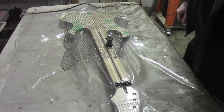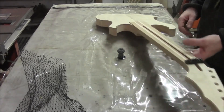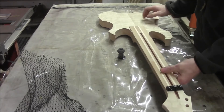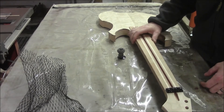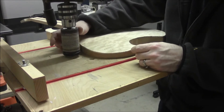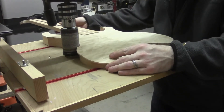Listen for any leakage — don't hear anything, so we're good. It's been about four or five hours and the glue's had plenty of time to set up. We've taken it out of the vacuum bag and here's our top laminated on — you can see the armrest there. Now we're going to take it over and set up a drum sander on the drill press; it's got a guide bearing on it. As you can see, we've got our sanding drum set up in the drill press, with a guide bearing on the bottom, and we're just going to go around any areas we can fit into.